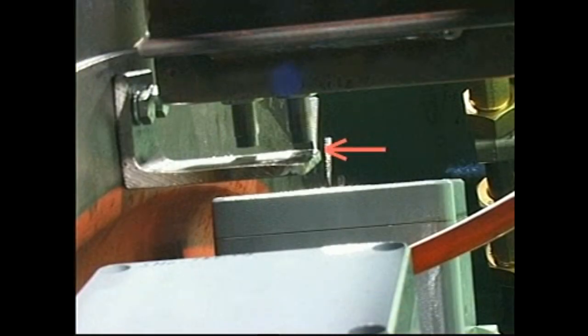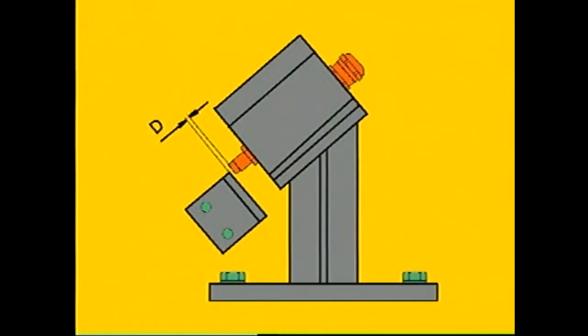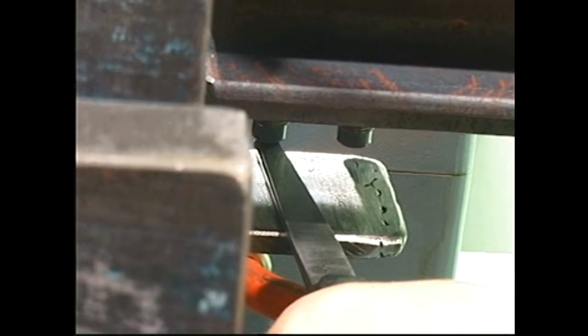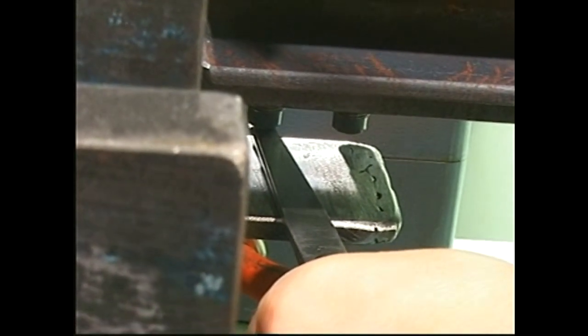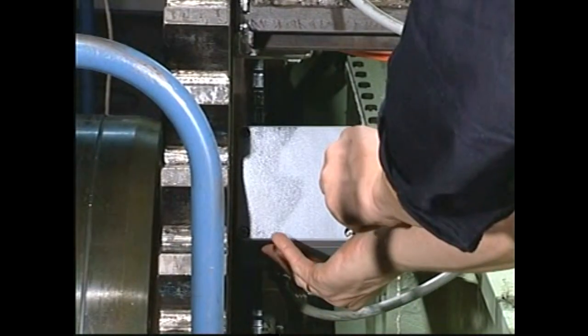Check that the uppermost edge of the marker plate is in the center line of the marker pickups. Check the distance between the pickups and their counterparts with a feeler gauge. See Instruction Book Volume 2, Procedure 905. Adjust if necessary. Remove the junction box cover.